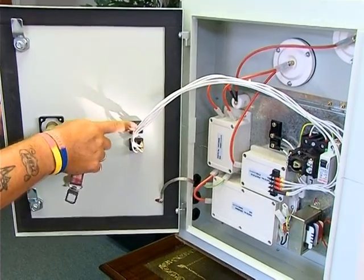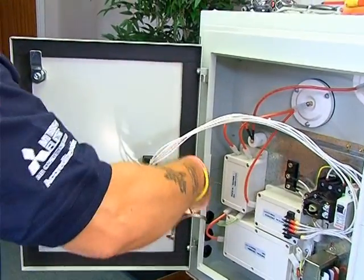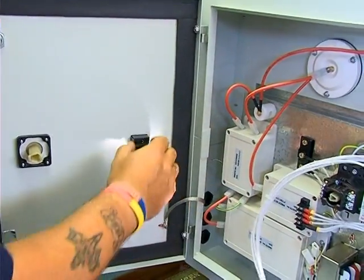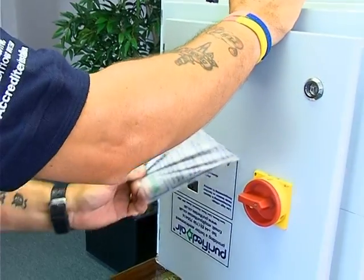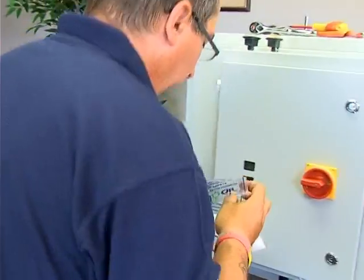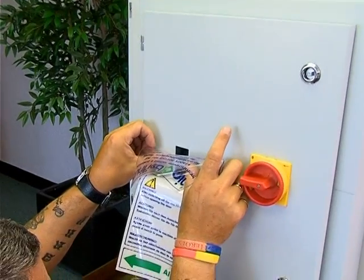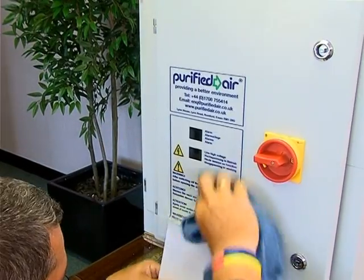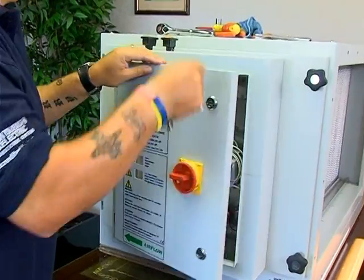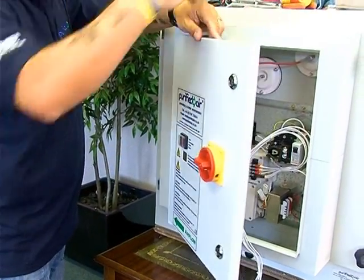Finally, you need to remove the existing sticker and replace it with a new one in the correct orientation. Remove the toggle switch and alarm lamp from the door, taking note of the sequence of the wiring, especially on the toggle switch. Peel off the old sticker, clean the surface and attach the new sticker. To help get the sticker straight, use a damp cloth to apply a thin layer of water to the surface before applying the new sticker. The water will allow you to move the sticker and line it up straight. When the water dries, smooth the sticker into place and it will adhere fully to the door. Replace the switch and alarm lamp.